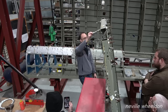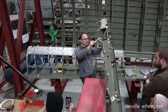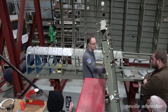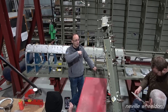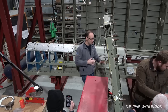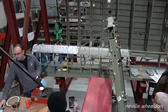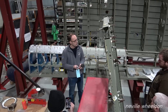You also find a lot more magnesium alloy in the wing. This piece is in the trailing edge — it's a magnesium alloy extrusion or casting that runs down the entire length of the trailing edge, right at the very furthest edge of the wing as you see it. I'll pass that round — but I do need it back. Magnesium alloy is used throughout the aircraft; the wheels on a Lancaster are made of magnesium alloy as well. Wherever that magnesium alloy has been open to the elements, it has corroded away.